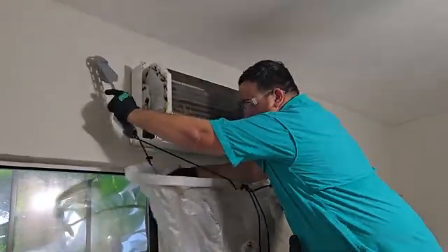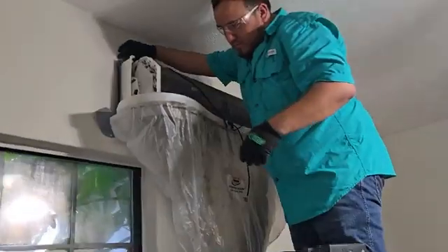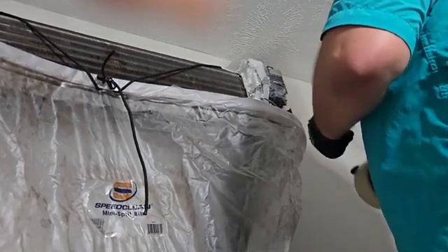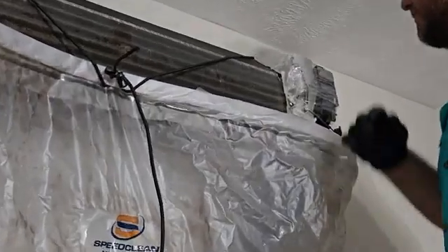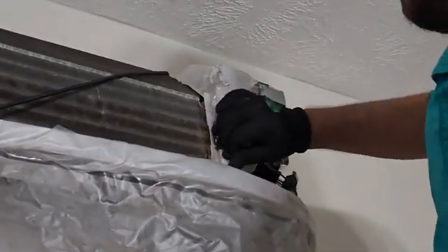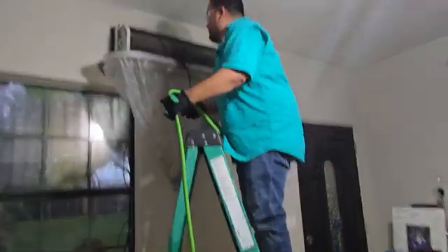Now we're going to put that mini split bib from the bib kit. It has these anchors that connect to the side of the mini split — you can see them on the left side and the right side. This is how it should look when you install that bib on the mini split system. Next, we cover the electrical wires and all the electrical components for the mini split system so we can keep it dry. Then we slide the water deflector right behind and on the bottom of the mini split.